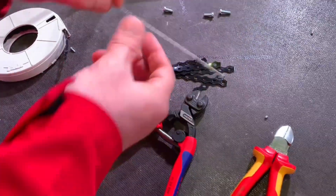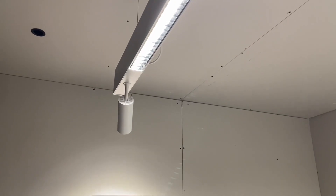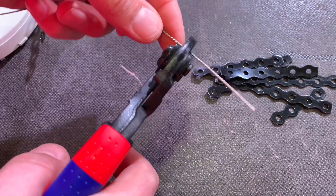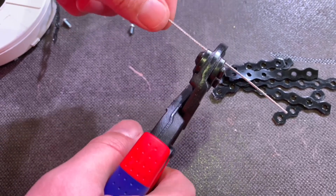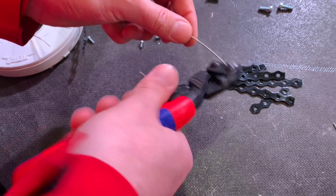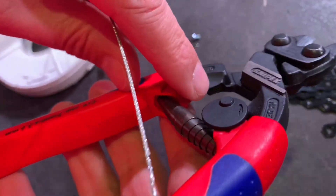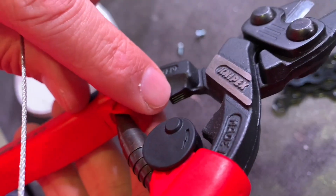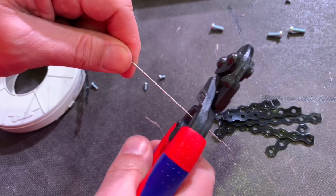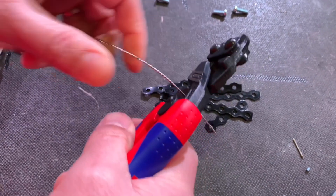So you've got some wire here to cut - where would we use this? This is a stainless steel wire we used previously to hang an extruded aluminium light fitting. They're quite popular with decorative lighting suspension kits. Look at that - it just chops through that very effortlessly. It's also got a little serrated feature in here - that's a grip function, so you need to pull the wire first to get some tension in it. That's what that feature's for.